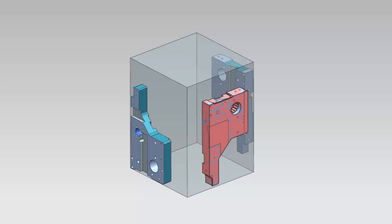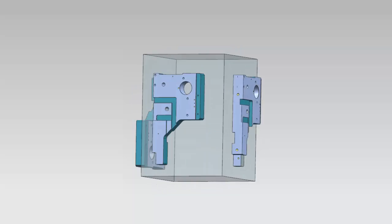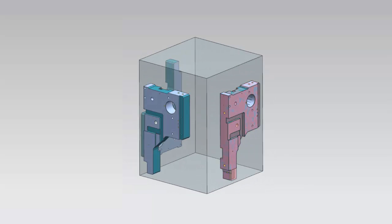Previously, NX could only position the IPW automatically by referencing the same part. The transferred IPW no longer requires you to specify a part, allowing you to either machine the IPW independent of the part geometry, or to specify part geometry that is different from the previous one, as in staged models.